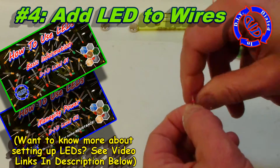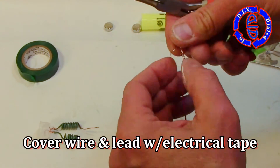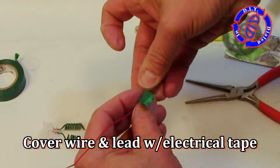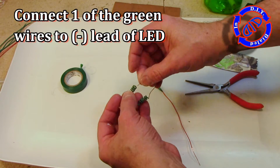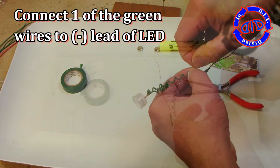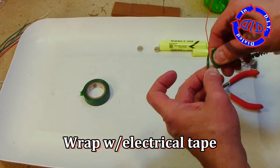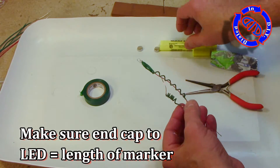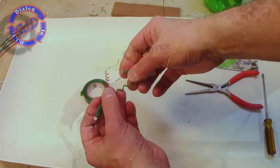At this point, we're going to go ahead and take our third wire and attach it to the positive lead on the LED. If you feel like you need to understand a little bit more about LEDs or need more comfort with the basics, check out the videos I have linked in the description below. Once you have your positive wire twisted in place, cover it up with a little bit of electrical tape. With that done, grab the bottom cap with the two sections of green wire, stretch one of them out a little bit, and connect that wire to the negative lead on the LED. Go ahead and wrap that one up with a little bit of electrical tape too, then take both sets of wires and tape them together to keep everything firm and in place. Make sure there's no point at which the wires from each side are exposed to each other.